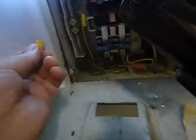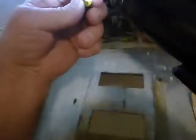It's because there's aluminum wiring. The aluminum's coming to this. See? That's called pigtailing. Now somebody pigtailed this, and what they didn't use is the right wire nuts. The yellow doesn't count. Purple counts. And there isn't any antioxidant paste in there. So they used the wrong kind of wire nuts and they didn't even use antioxidant paste. I'm trying to get rid of the aluminum controversy.